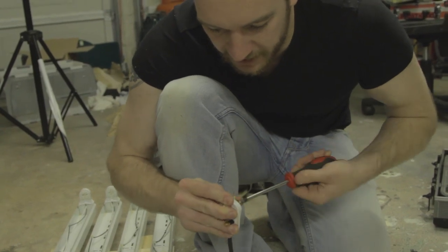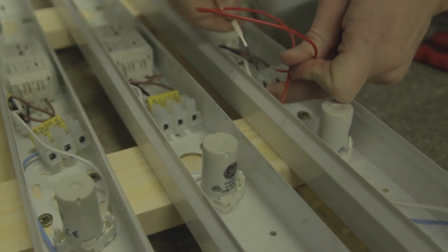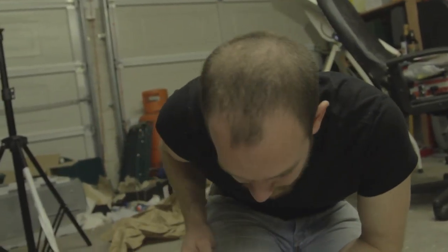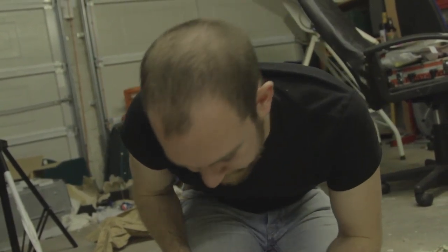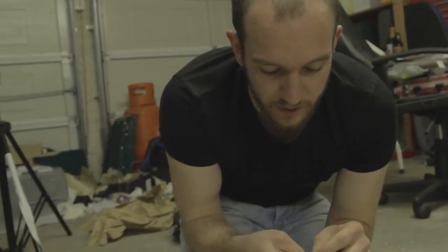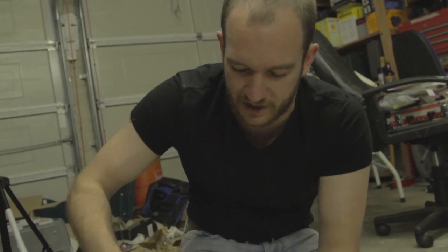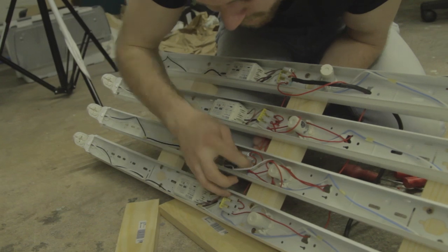I'm not going to teach you how to wire up a plug, because frankly, if you don't know how to wire up a plug, you shouldn't be doing it. One thing to remember when doing this — it's a motto of my dad's — a good stripper makes any job easier. So make sure you've got something that's sharp. This last bit we're doing now: we've done all the lives, we've done all the neutrals, we're now doing the earth. Effectively what that's doing is just connecting the earth in the house socket to the metal of all of this framework — very, very important step. It will work without it, but you won't. You run a much greater risk of blowing yourself up, and it's a five-minute job to earth everything in. Definitely worth doing.